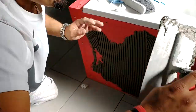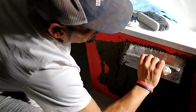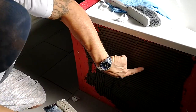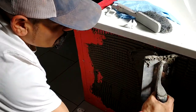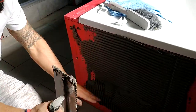So here we go. Sideways is fine — you're going to go sideways like that, come back, come back, and go over it. Make sure it's got that coverage. See how it's missing — it's smooth there and it's missing there — that means you need more mud. Everybody watch this. See that? That's how you want it to look, just like that, all the way around.